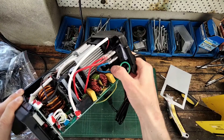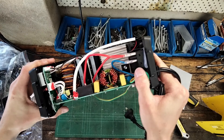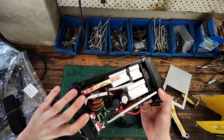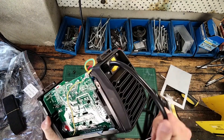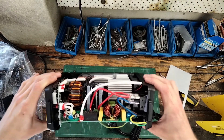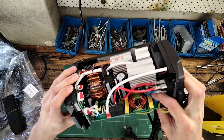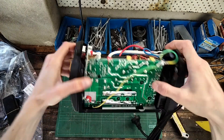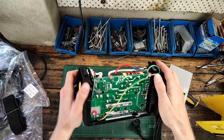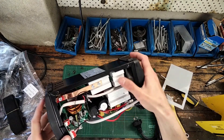On this side I can see an IGBT. As the box says, IGBT technology — it's a special type of transistor that's really good with high voltage and high current. The maximum input at 240 volts is 25 amps, which is a bit much for a MOSFET, so they use IGBTs. We've also got our bridge rectifier which takes the AC input and switches it into DC, stored in the capacitors.